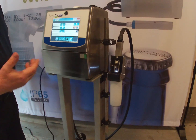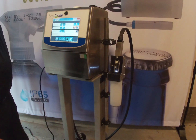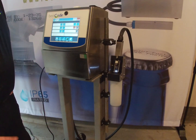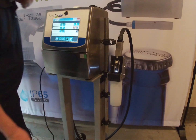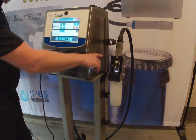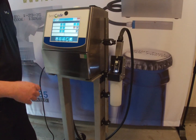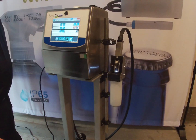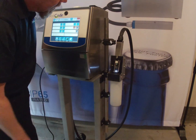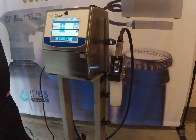You'll hear straight away the jet start up, the vacuum on the return gutter. We can do a little visual inspection to make sure that everything's running good and the jet is running indeed into the gutter, and that it hasn't splattered everywhere onto the print head here. Sometimes on first startup you may get a little scab on the nozzle plate that has to go through, so it may start up messy for that first startup. So now we're up and running, and the print head looks like everything's running good. So now we're ready for the next step.